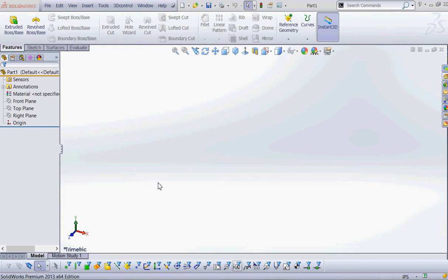Okay, the next thing is, I want you to understand that this is not how I want to see it dimensioned in your drawing. There are a bunch of errors here. You've got dimensions to center lines, you've got dimensions that are not to between views. So if you have a drawing that looks like the drawing on page 3-88, you will not get a good grade. Okay, I'm going to tell you that right now.